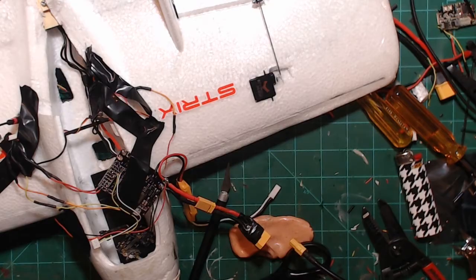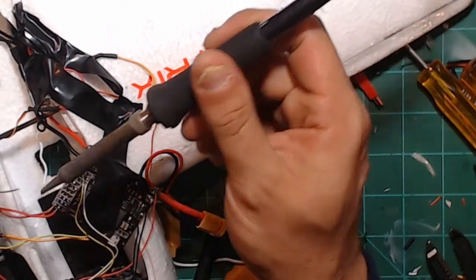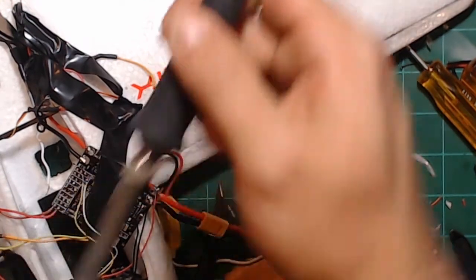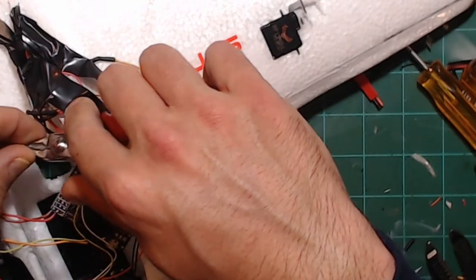You can zoom in a little bit to see that better. On the CL Racing board, the motor connections are actually on the sixth pad up from the bottom — 1, 2, 3, 4, 5, 6 — right there where I have that single dot. This ESC does have a ground wire so I'll put a little solder on there and solder up the ground pad too. It needs tinning a bit — I don't like doing this so close to the board. That is a little long so I'm going to go ahead and trim that down.